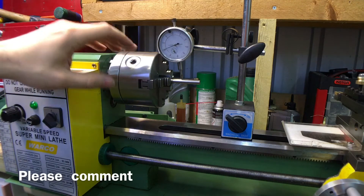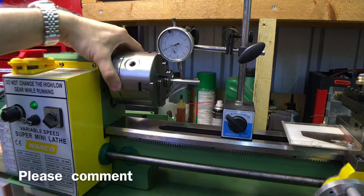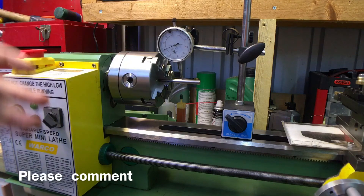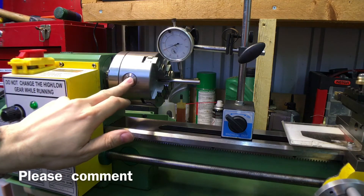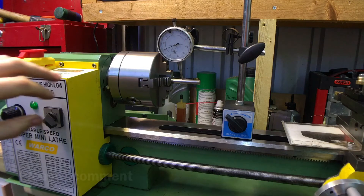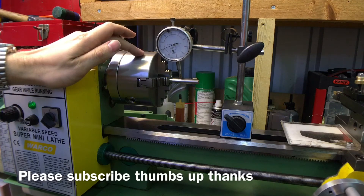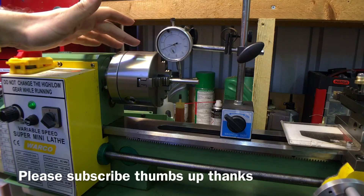The one thing — did you hear that clicking noise when it was turning? The pinions are quite loose. I don't think it will affect the chuck in any way, it's just a slightly annoying noise — my three-jaw doesn't do that. But yeah, I'm pretty happy with it. This was the cheapest four-jaw self-centering chuck I could find in the UK, and it came from Chronos Engineering.